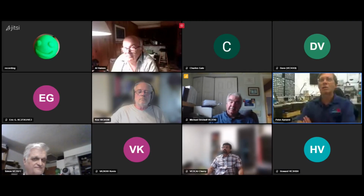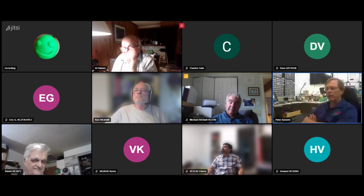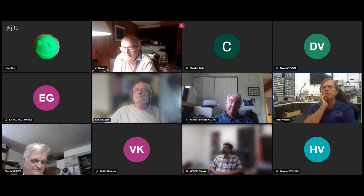That's great, Al. That little trip down memory lane, like Dave made a little notice there, the 8307 we used in our SNA project. And actually, way before we even moved to Kingston, I got interested in that 8307 chip and did a lot of experimentation with it, had pages and pages of data on it. I didn't use the meter like you did. I scrapped the op amp and fed the output of the chip directly into an Arduino, and then I just read the power levels off of the screen.